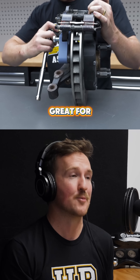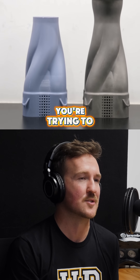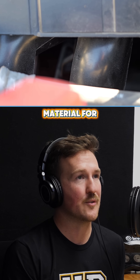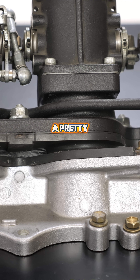The most basic material that everyone prints with is PLA — great for prototyping and some end-use parts, it just depends what you're trying to do. If you step up to something like nylon or polyamide, that's a really good material in terms of abrasion resistance and toughness.